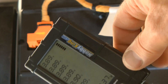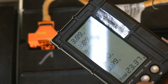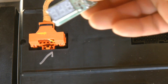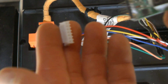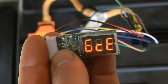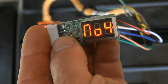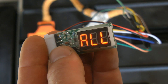Whereas the Battery Medic is about $16 to $18 shipped, they get expensive if you need 12 of them. HobbyKing.com sells another product which has absolutely no documentation, and it looks like this — and I think it was less than $2. So if you plug this in to the same pin, it's going to do this: it shows the whole pack voltage, then number one cell 3.88, number two cell 3.86, number three 3.91, number four 3.88, number five 3.89, number six 3.89, and then it cycles back to the whole pack voltage.